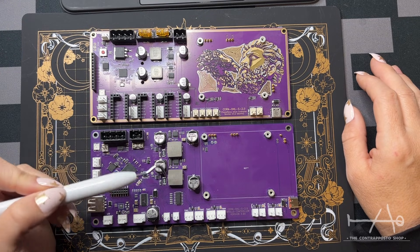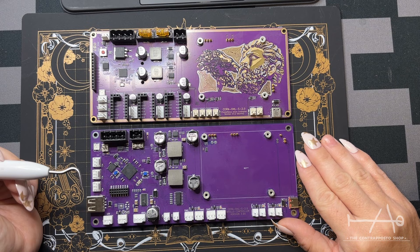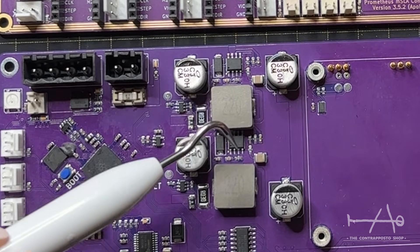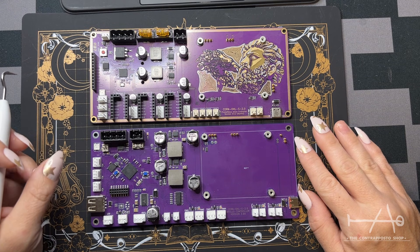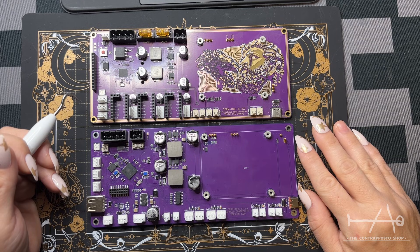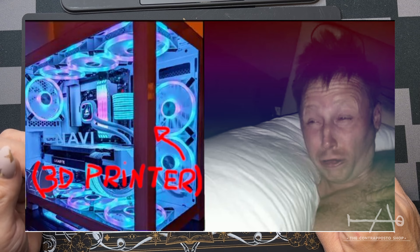Let's start with the PSU part of the PCB. We are still using the same step-down IC because they have proven reliable in the past, giving good performance without needing a lot of passive components, keeping the BOM low. One gives us our 5V rail and the other the 12V one, both capable of outputting up to 5A continuously. At the output of each one we have an e-fuse for protection. We've also included their own separate shunt and amp meter, which send data to the MCU so we can monitor power usage in real time and be notified if we're approaching overload.